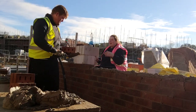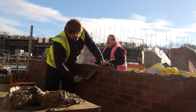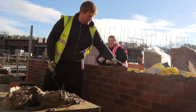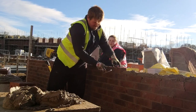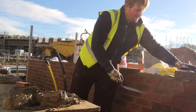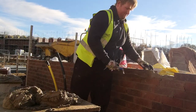As you can see using the long bed pick and dip here — I have a drop zone and the mortar is quite wet. In winter we scrape everything up from the back to reuse it; you can get quite a few more bricks out of your mortar that way, especially with ready mix. With these bricks you can't really get a one-scrape bed joint — the mortar's too wet — so it's a minimum of two scrapes. You'll see me doing a couple of scrapes, a little shoe-shine on them. This footage is probably the quickest and most accurate I've laid them.